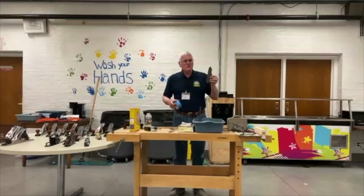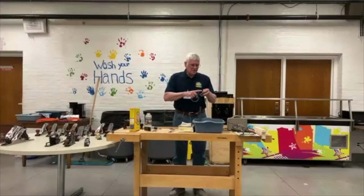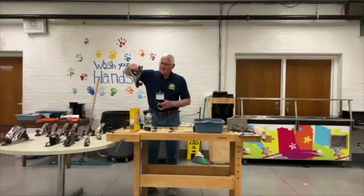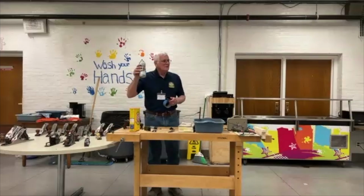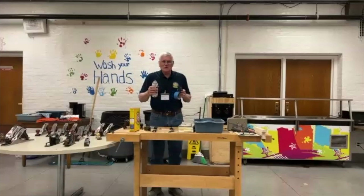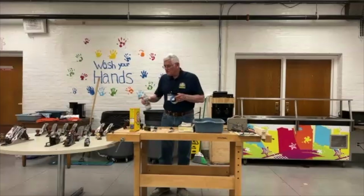I've done it long enough so I know where the Japanning goes. So I'll take tape and I'll take a blade, a box cutter, and cut so it goes right around here. And the top gets painted. No, the top does not get painted. I cut around the edge. So there's no Japan, and that just has paint on it. It has about, all of them the same, about 5 coats. And I like using this because it crinkles and it looks like Japan. Rust-Oleum hammered. When you spray it on anything, it bubbles up a little bit and then it hardens. So the bubbles break, but it still left the impression of the bubble. And that's what Japanning kind of looked like.